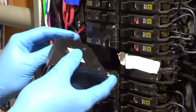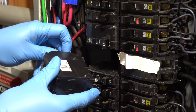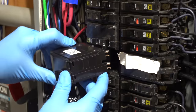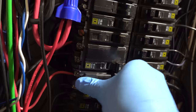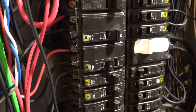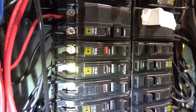This next step can be done a couple of different ways. Many people put the breaker in first and then insert the wires. Because things are so tight here, I'm actually going to put the wires into the breaker first, then press the breaker into the panel. But the job's not over yet — don't assume those wires are completely tight. As you move them around and push the breaker in, they'll adjust a little, so you need to make certain they are still completely tight.